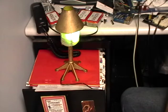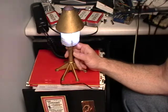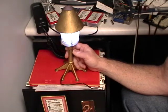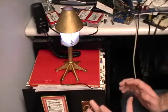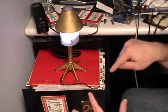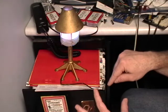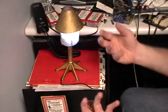And then this, I think, is kind of cool. Looks like lightning, but it's a snake. I've treated the 15 lights that are on there as a grid, where you'd see the old snake that goes over itself. It won't run into itself, but the pieces of it are different color temperatures, where the head is 10,000 degrees Kelvin, and then 5,000 degrees Kelvin, and 2,500 degrees Kelvin, and so forth, down to just red hot, which is like 900 Kelvin, I think.